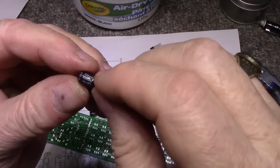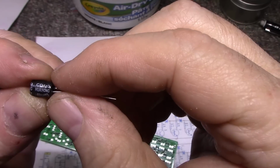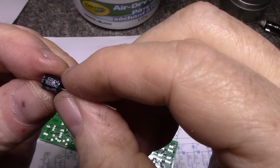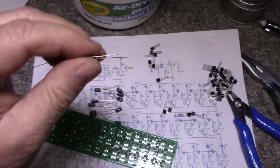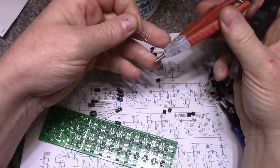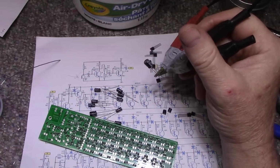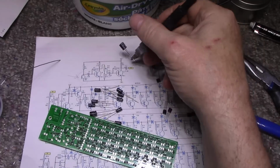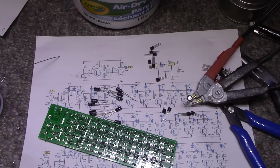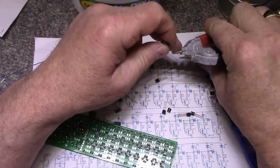These are China brand, Wuhong, Huahong. This is a 220 at 16. Let's see what it says. Oh, it reads 191 microfarad. And what's our ESR? Okay, 190 microfarad. It's not the greatest.